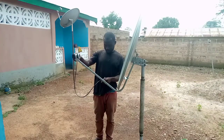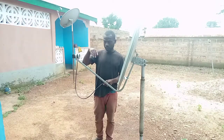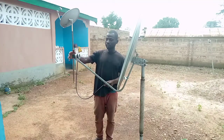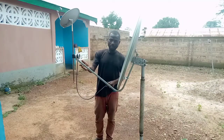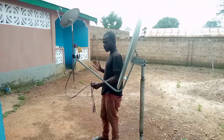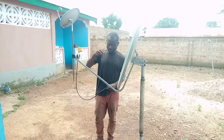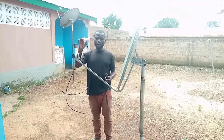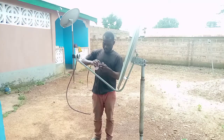I've gotten the signal. Right now I'm going to add the 42 degrees so that both signals will be on the same dish. As I said, to track this angle, you first track for your DSTV signal. After that, you move towards your left and then go down. This is now my 45 degrees done. I now have to use the secondary LNB for the angle 42. When I'm done with the video, I'll put those frequency numbers — the TP numbers — on screen for you.